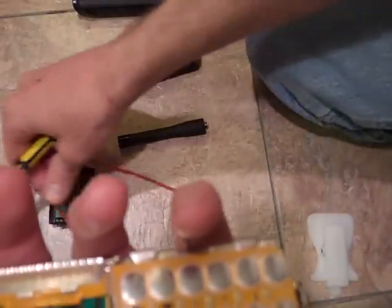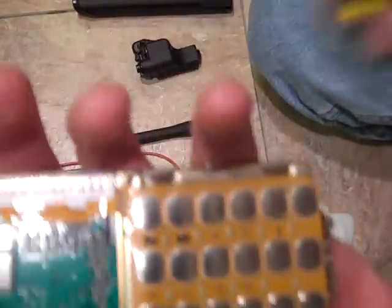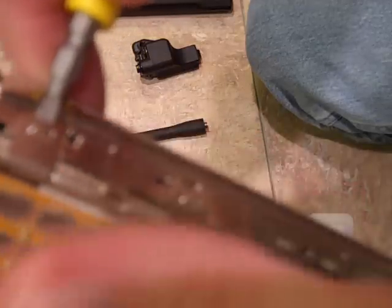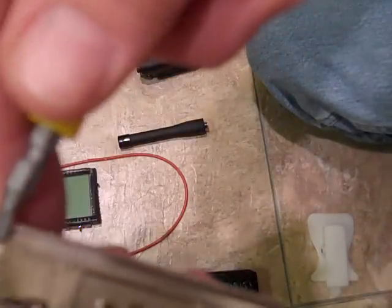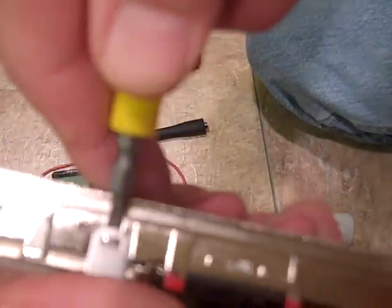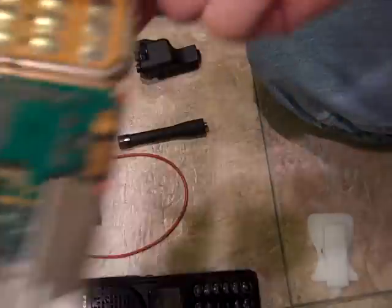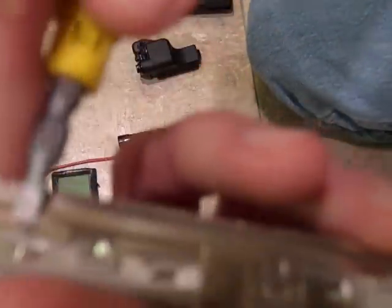Now the first thing is to carefully remove the o-ring. XTS 3000 o-rings are pretty sturdy, but if you try to lift them up without the right tool you're going to break it. You've got two clips here — you can gently take a very small screwdriver that just reaches the groove. Stanley makes one. You can pop these two clips out.